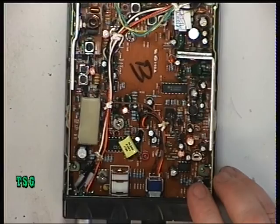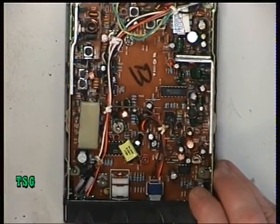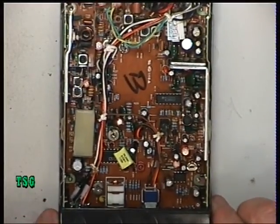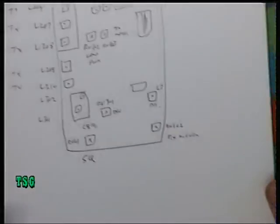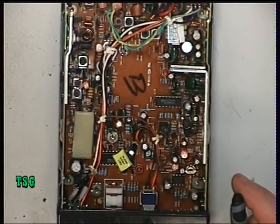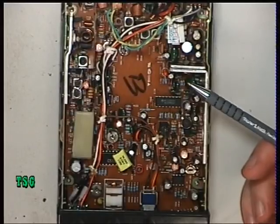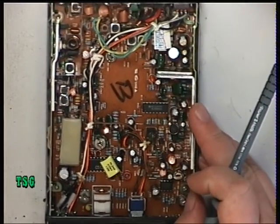Okay, so we've opened it up. I've just done a standard mic for it as well — I don't know where the original mic went. The good thing is we had the original instruction book, and you'll probably be aware that Midland instruction books back then included circuit diagrams, layouts, and all kinds of stuff, so I've been able to make up a tuning chart. We would have serviced this when it arrived new in the late 80s. The big difference is there aren't all the transistors in the receiver that were on the UK version — it has a single inline microchip which does away with those transistors.